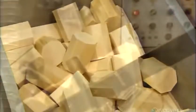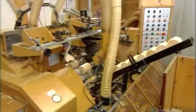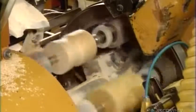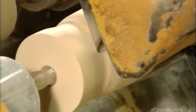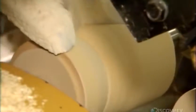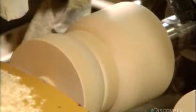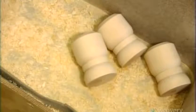A conveyor feeds the pieces one by one into an automatic multi-station lathe. The first station rounds out the octagon, then forms the basic torso shape. The second station finalizes the shape. Then the next four stations sand the wood smooth, so that the wood stain they'll apply later on will penetrate well and evenly.